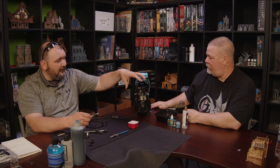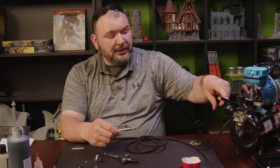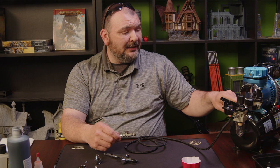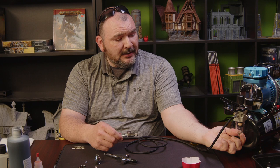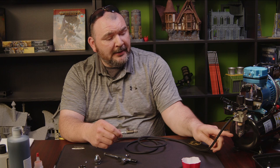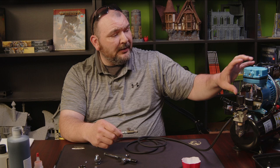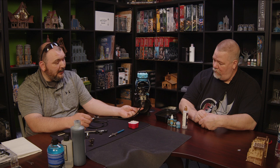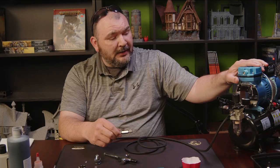A couple of different components of a compressor: you've got the motor on top, the air tank on the bottom, and a big housing unit. There's a pressure gauge — it's important to note it does not tell you how much pressure is inside the air tank, it tells you how much pressure is coming out to the airbrush, adjusted with the knob on top. At the very bottom you have a clear glass jar with a little pin — this is a built-in water filter. As the compressor runs, warm air goes into the cold tank and condensates. That moisture gets trapped here, and pushing up on the pin blows all the water out.